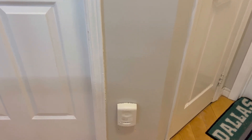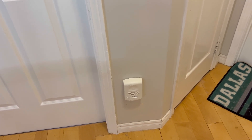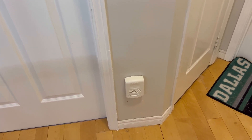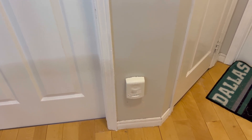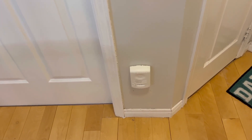Basically, how I did it is that this house had a central vac system roughed into it, but it was never fully utilized, so I was able to take the existing cable in the wall that jumped from here down to the first floor and then to the basement. I fished another wire through the basement just to the first CO detector, and that way both of them have four wires, because you need two wires for power and two for the input.